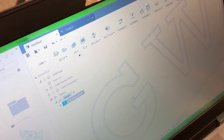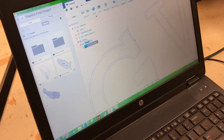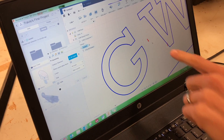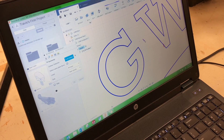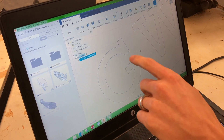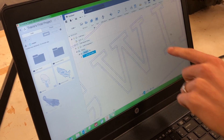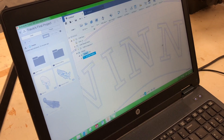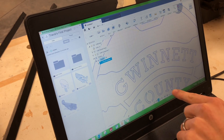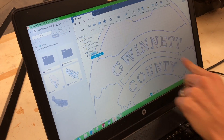Now you see — this is switched. Now you're going to have a hole in the middle of your part, like the stars. So now it's going to start here and come out, and the G is going to be wrong. That's why I was misunderstanding earlier when I was looking at the red ones. So I'm going to go back and click that arrow to go to the inside. What I like to do is go through and click all my lines, then review it on this screen — just pan the screen and check: this one's okay, this one's okay. You're just looking for that light green line to see where it's going to start the cut, making sure it's on the inside or outside, whatever you want. If there's a profile on the outside, I'll fix it right then.